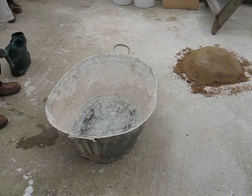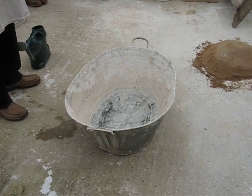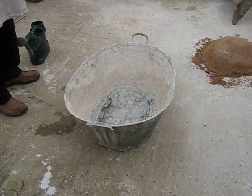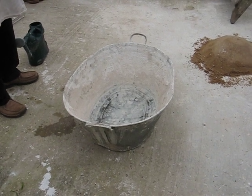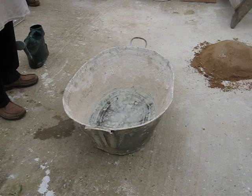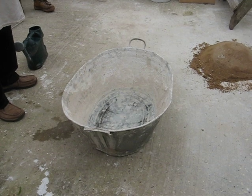The other thing to remember is lime must be used fresh. Quicklime must be used fresh. If it stays too long — nowadays we have plastic tubs that will keep for months — but in the old days, if you didn't use it within a week, it became what is known as fallen lime. In other words, it would be in a bag, and when you opened the bag, it would have begun to go to a powder. And it's actually no good to work with then, because the energy that was needed is gone with it.